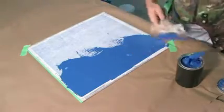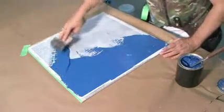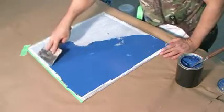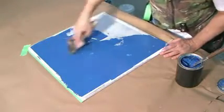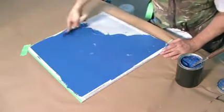Begin by dispensing base coat evenly across the edge of your plaster trowel and apply the base coat to the wall surface in a curved pattern, avoiding repetitive linear strokes. Linear strokes become visible during the top coating and are not desirable in this application. We recommend a random skip trowel technique.